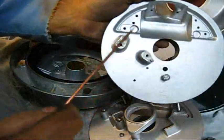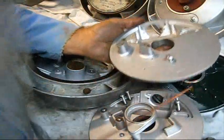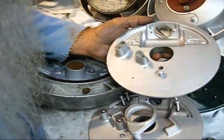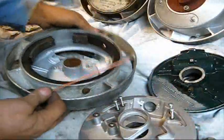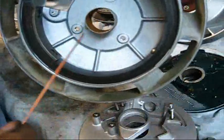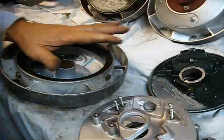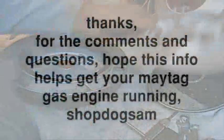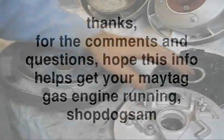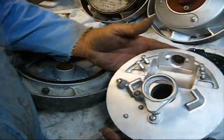We'll get to the point set at some point. You may ask how come I didn't just go ahead and time that engine and be done with it. The reason I have not done that is if you do not have a good flywheel magnet, then this point setting and timing is of no use. It's going to be continued - we're going to get her done, just fun here in the backyard shop.